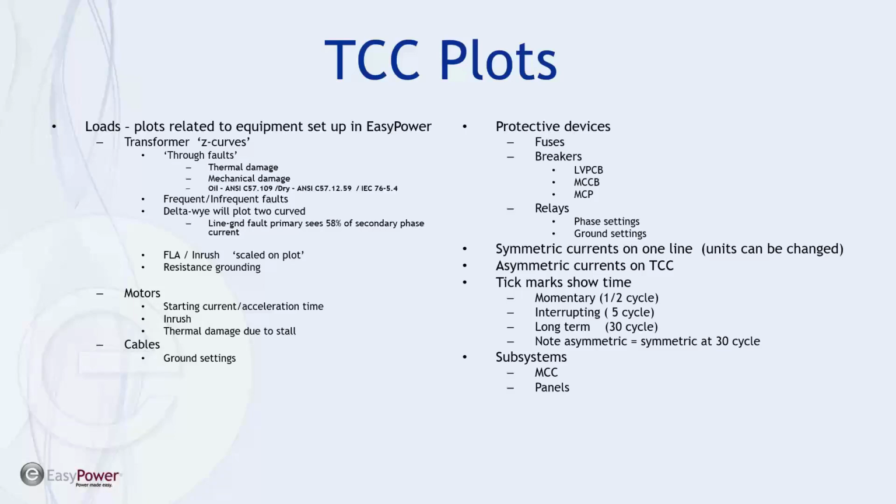Well, that was the other thing I didn't mention on the infinite time or the unlimited time to run at greater than 6 times full load current. Why would I care about that? Well, for starters, a full 3-phase bolted fault would shut everything down, whereas if I had a very low resistance fault, it could potentially trip a breaker if it was set too low. So that's the purpose of coordinating on lower current than the full load faulted bus 3-phase bolted fault load.